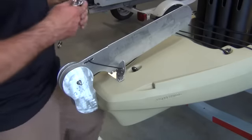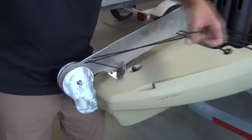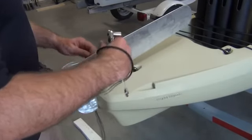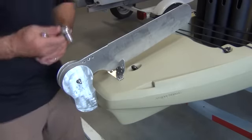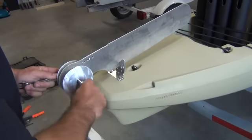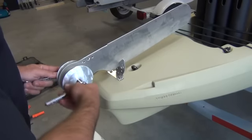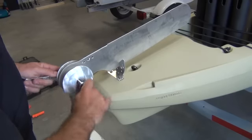Let me grab a socket wrench and pop this off real quick, pull my lines. I've got to disassemble this thing anyway because I still have some finish grinding and sanding to do on it and I'll get it ready to paint. This is a nylock nut over a quarter inch washer. The nylock is almost a must-have because you don't want to tighten this all the way down — you want it to be snug when everything is sandwiched in there together, but you don't want it to bind.